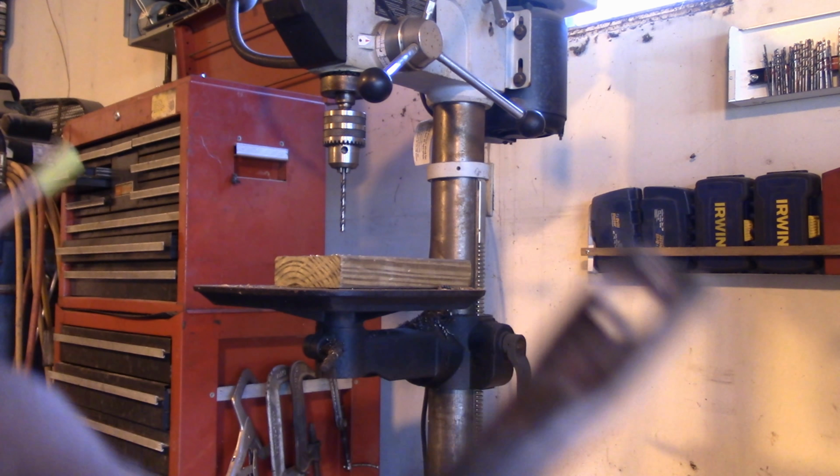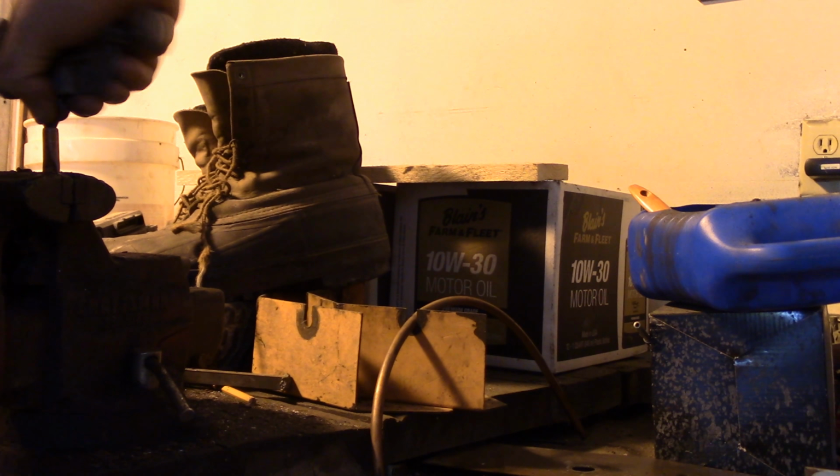Okay, the next thing we're going to do is take this reamer and ream out that end. With that big long handle we had on there until right now, we didn't have to use a vise to hold anything until this operation. Once I'm done here, we are effectively done making it. Then it's just a matter of putting it on the cable itself.